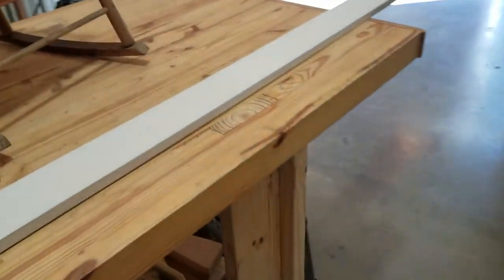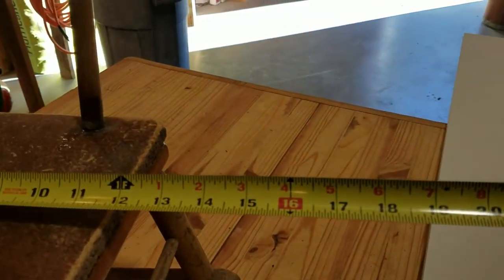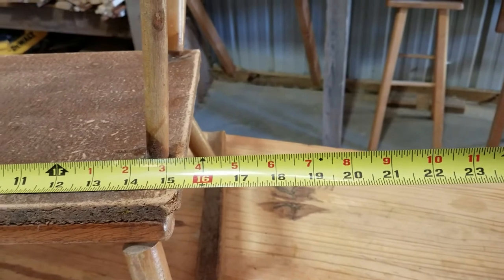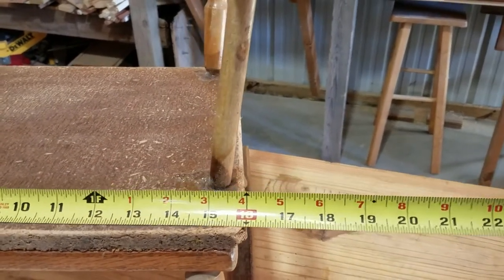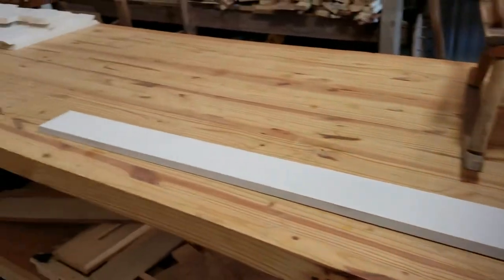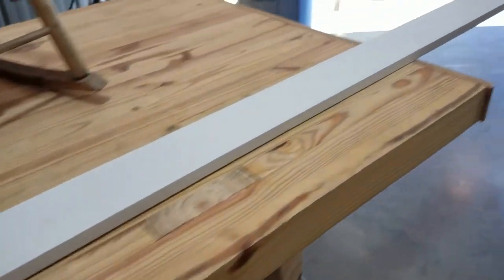We're going to start out and figure the dimensions. I've got a piece of 1x4 pre-painted which I didn't really want but I have it available so we're going to use it. I'm going to figure out the seat — we'll probably make them about 14 inches long. The seat right now is approximately 14 inches so I want 15 or maybe a little better width. Using a 3.5-inch board, five of them would be enough. That's 70 inches total. We're going to go ahead and joint the edges to make sure we get them good and square, get the paint off, then glue it up and go from there.